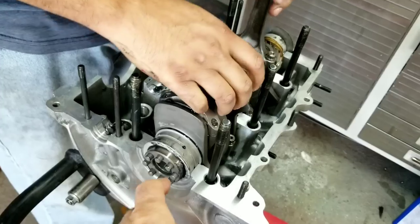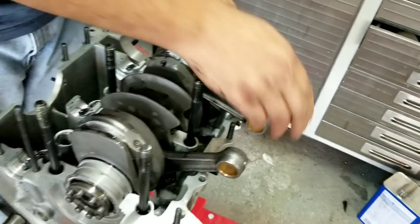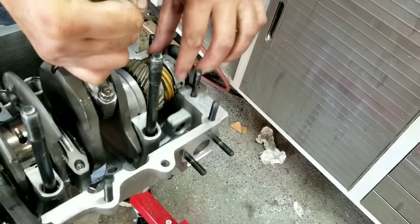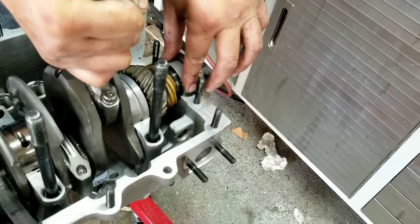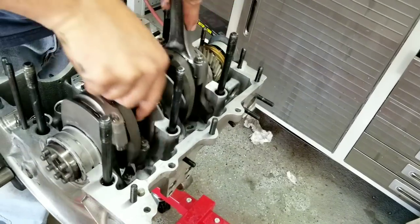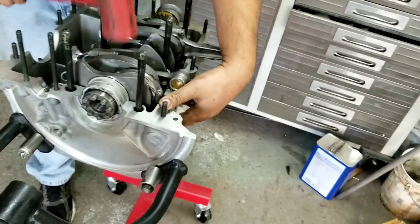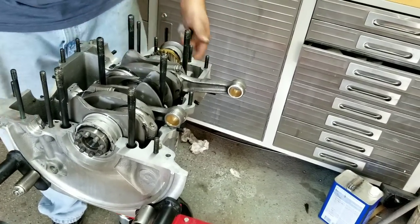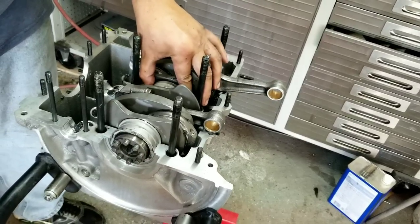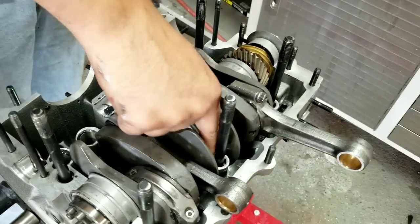The bearings are marked so we can find the holes — there are little set pins. Drop it in, turn it around to find the hole, same thing up top. Turn around a little bit so you know you're in the dowel pin, and then it'll seat itself. Do it by feel, but the best way is to mark them and check it. Make sure you have good rotation, then tap it to make sure it seats — the dowel pins are sometimes really tight.